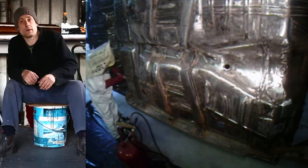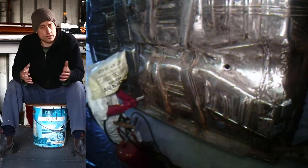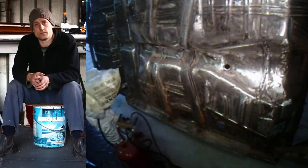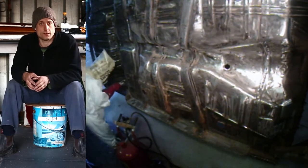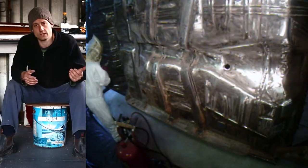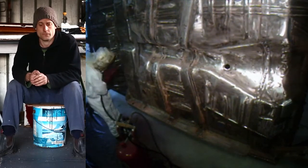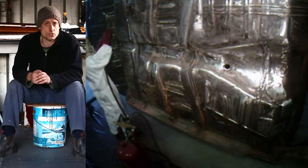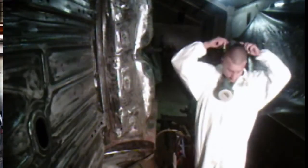I had just enough air to make this worth doing — about 18 cubic feet per minute. So I wanted there to be no restrictions between the air compressors and the tip of the blaster where I needed to create the pressure. So it was all taps open with a pressure regulator on the entrance of the tank, and I pulled that down to about 90 psi, just so that the air compressor could hopefully get ahead of the blaster.